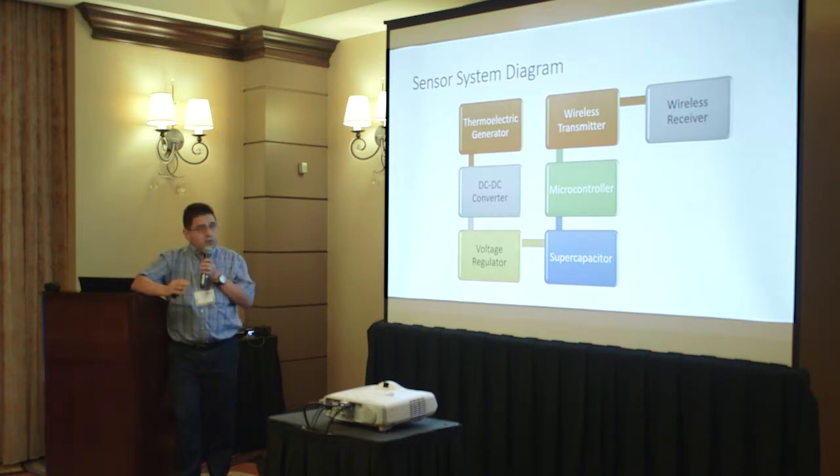The internal memory can be expanded to much larger flash memory, and we will be storing data on the road as we keep measuring day to day over a long period of time. The supercapacitor that we added is only needed when we are trying to transmit this data to a passing vehicle wirelessly. Wireless transmission requires a larger amount of power but only for a very short time, which is why the supercapacitor provides the current the wireless transmitter needs.